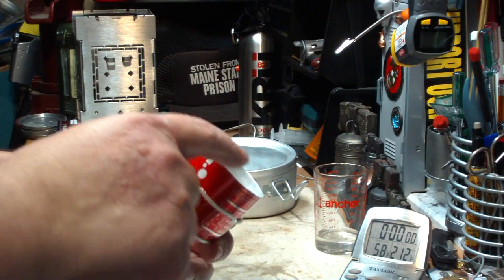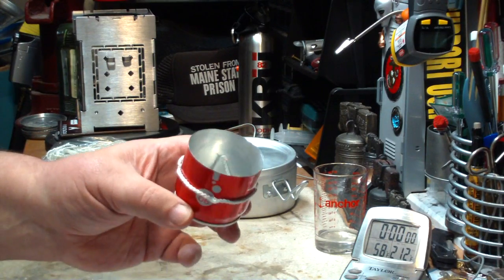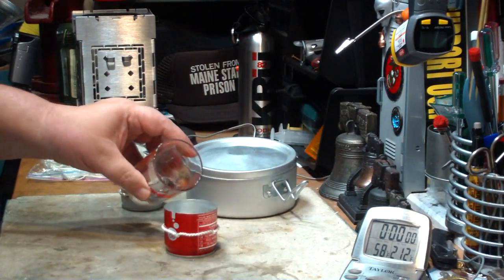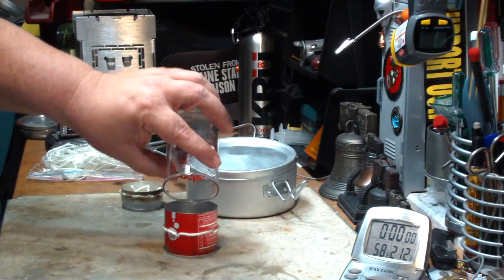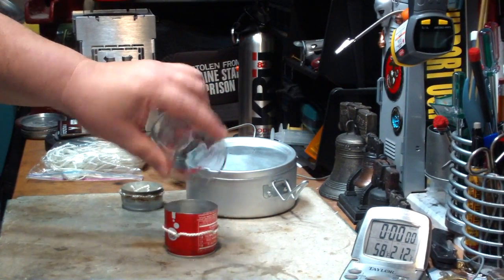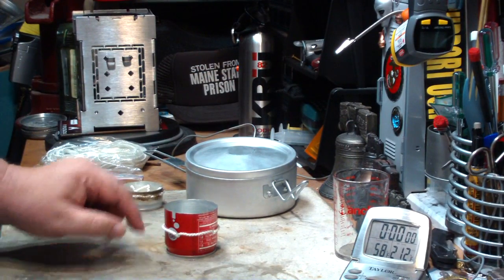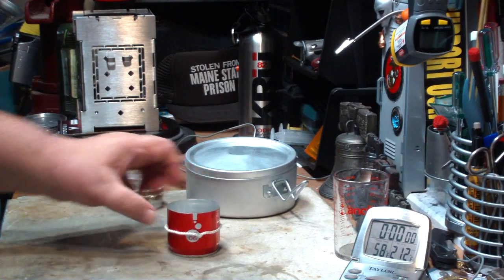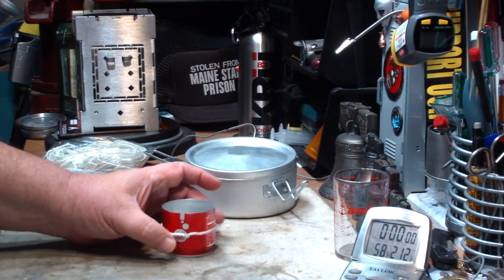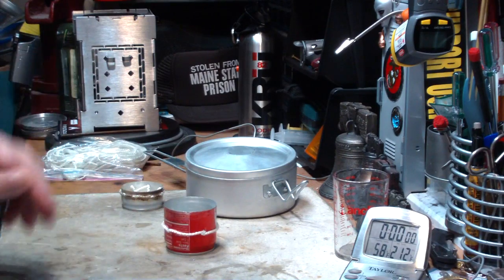So this is two inches tall. I didn't worry too much about getting this all flat — I don't mind if there's some gaps for the gases to get out, because this will heat up and the alcohol will want to vaporize. I have half of an ounce — a fluid ounce of methanol — put that in there so it soaks into the wicking. I'm hoping that this will still work even with having fewer holes in it, that it will pull the alcohol from both holes and go across. See what happens here — it feels like it's getting wet; that wicking really sucks it up.